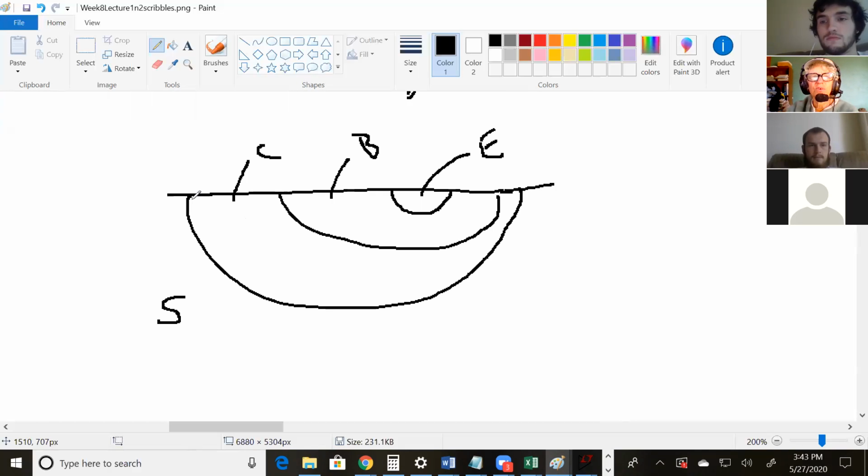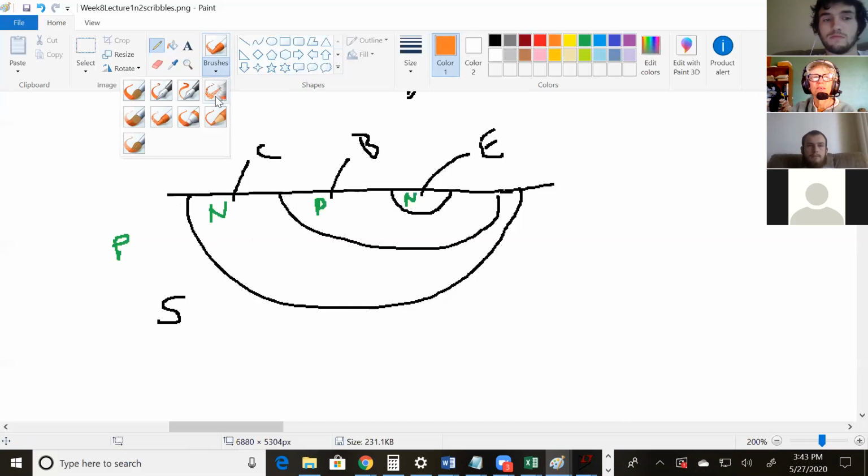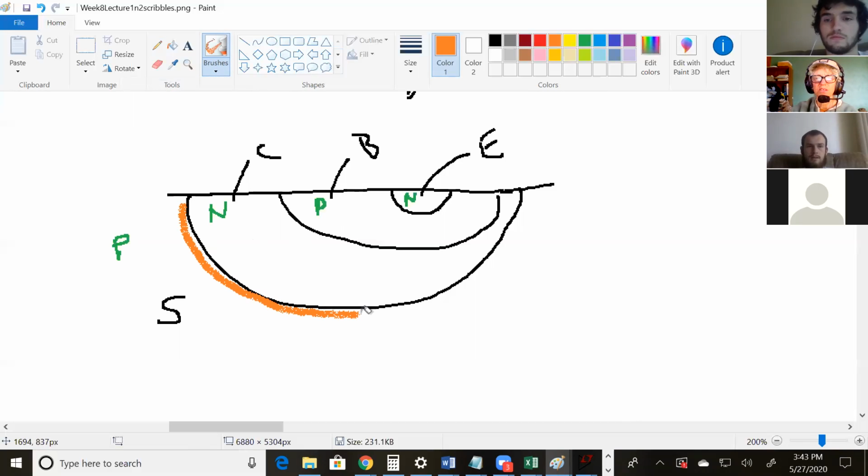If we are in forward active, or actually any region of operation, let me draw this in. So the substrate, if we're looking at an NPN, the substrate would be P. This is N, this is P, this is N. In any region of operation, is this PN junction conducting or not conducting? Not conducting. So when it's not conducting, what forms around the PN junction?